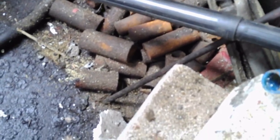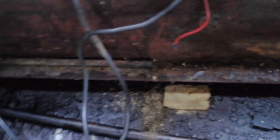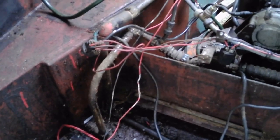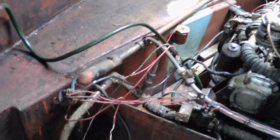And you can see more of these pipes here — thick walled pipe, dense stuff, it's heavy. That's the ballast they've used 40 years ago. So we need to get all this out, clean it all up. When the engine comes out anyway, we're going to divert all this — the 25mm copper pipe that goes around the engine — we're going to re-route it all, because it's going to interfere with the steps coming down out of the boat there. The platform up here to stand on, then step down to the left, down to that counter and then into the boat. So I'm going to re-route all that lot, and we're going to get all this lot cleaned out now.